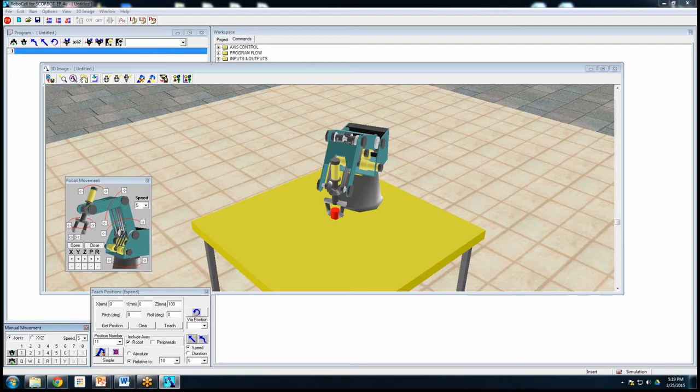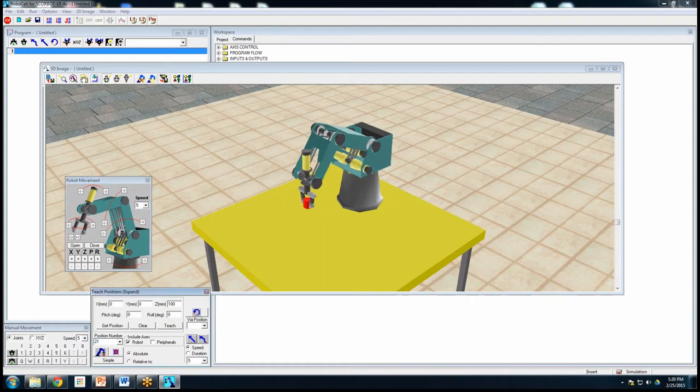I compare this back and forth to CNC software. I'm not going to write a purely relative or purely absolute program — I'm going to hop back and forth all the time. All my up-in-the-airs will go wherever the ones on the table go. So if I say position 21 is on the table, I can say 20 is relative to 21, down 100, and put it back onto the table exactly where I want. If I ever move 20, 21 will move too, or vice versa. That's the only way you really want them to start grasping relative.